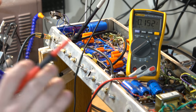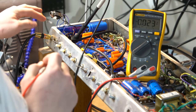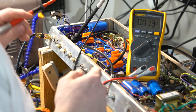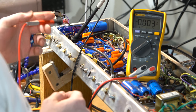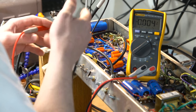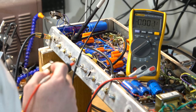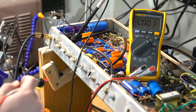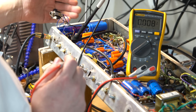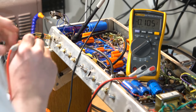Alright, hello everybody. Today I'm going to take a break on trying to figure out the low output problem and I want to quickly figure out how to get the FET board working. I'm going to turn the amp on and check the voltage at the input. Then I'll desolder that power connection with the amp off, pull this board out, and provide that power with my power supply instead, since what it needs is DC voltage at that level. So we're going to turn this back on for a minute.